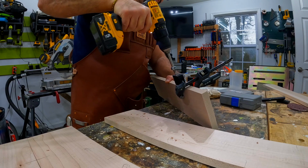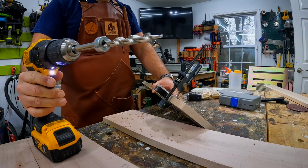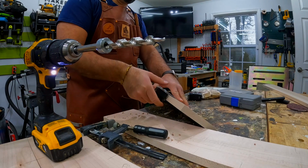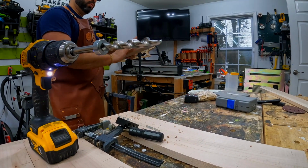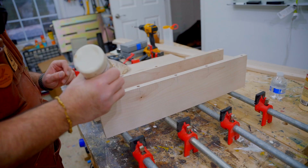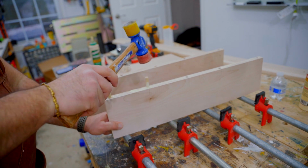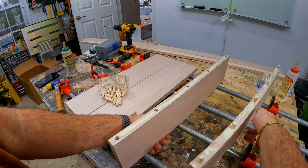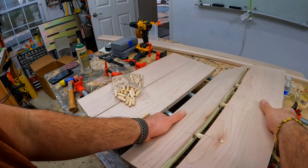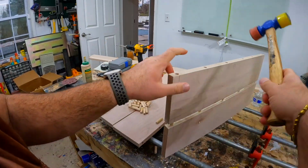This is a pretty easy joint to mess up if I don't ensure that I'm drilling the holes in exactly the same spot on both sides of the boards that are being joined. Therefore, I lined up all the boards and did my best not to shift or jolt them at all. This was a lot more difficult than I expected, as I used this square to mark perpendicular pencil marks, and I'd find that the wood could slip pretty fast on the table if I put too much side pressure from the square being lined up with the edge.